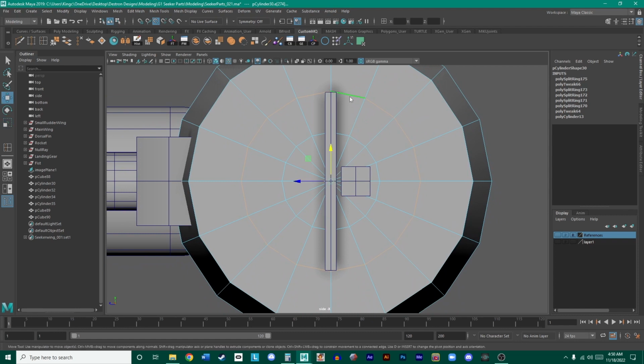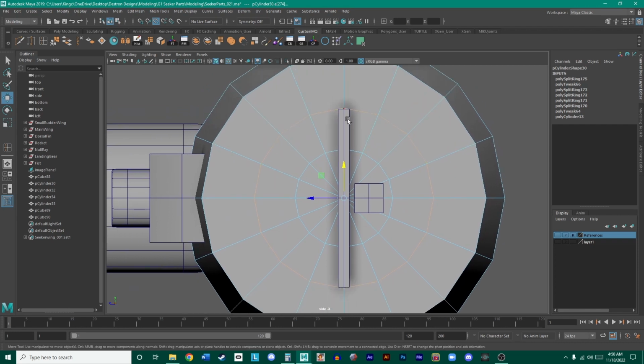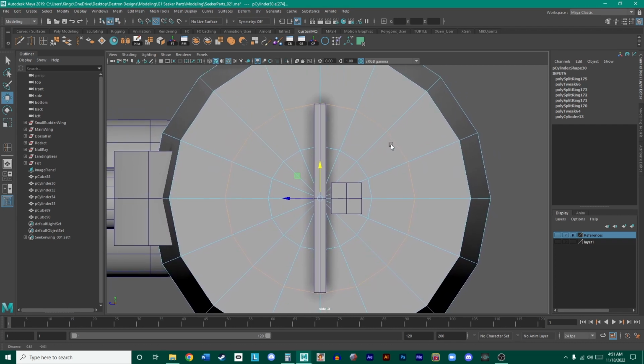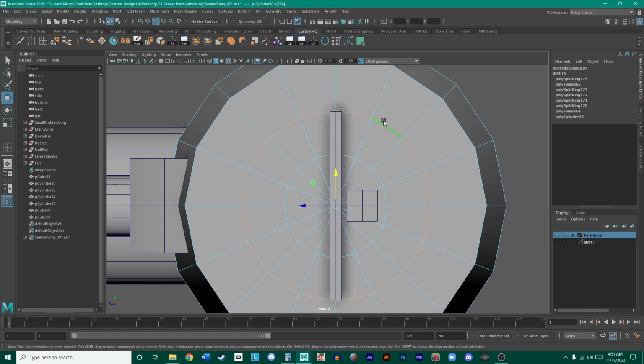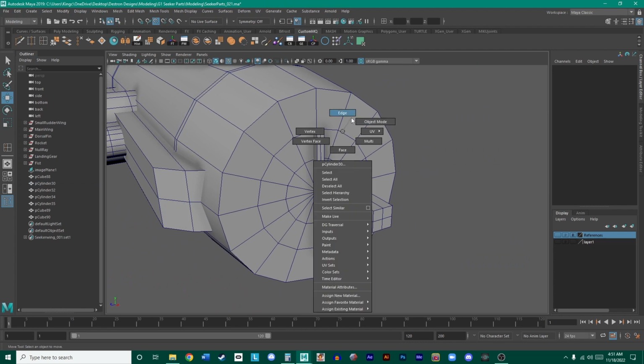Yeah, that's fine. The cap is going to be FDM printed, but this is going to be resin printed. But the FDM prints tend to shrink more than the resin prints, so I'm doing it a little bit smaller. I'm going to have to adjust all this anyway, but it's good to try to put it in there.